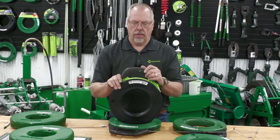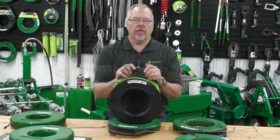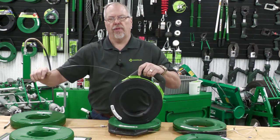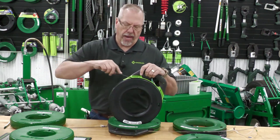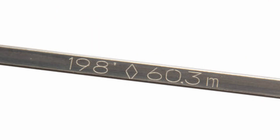We also have digital laser marked fish tape. As we pull that out, there are going to be digital markings or etching into that fish tape so that you can see the distance — every foot and meter, I have markings to show you the length of the conduit run. Now you know how much cable to buy if you don't know how long the conduit run is.